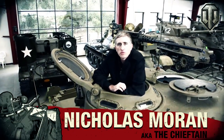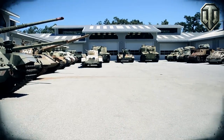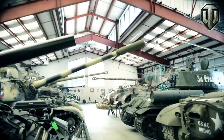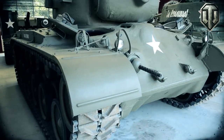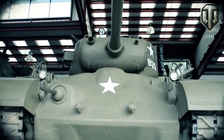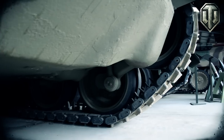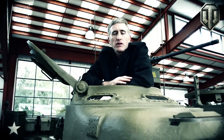Hello, welcome to our series of videos in which we're going to take an in-depth look at various tanks. We're at the Military Vehicle Technology Foundation in Portola Valley, California, and in this episode we're going to have a look at their M26, known as the Pershing. The M26 is defined in a manual as a heavily armored, fully tracked laying combat vehicle of low silhouette with torsion bar suspension and individually sprung road wheels. Now whilst this may seem pretty self-evident to us now, it is important to remember how much of a change this was from its predecessor, the M4 medium, known as the Sherman.